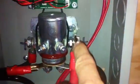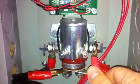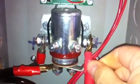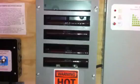You want to hook the turbine up slightly differently using the disconnect method, as they call it in the book. With the turbine, here's your positive — it's connected to this relay terminal. When the voltage hits 14.4 volts — and you can change that with a switch here to set it wherever you want, but 14.4 is factory default — what happens is the wind turbine continues to spin under a load. We don't kill the load. That excess power goes through this relay to this terminal and out into diversion mode, where it just burns up that excess energy. It accomplishes the same purpose of stopping the batteries from being overcharged, but it allows your turbine to continue working under a load so it's not free spinning. That's how that's hooked up.